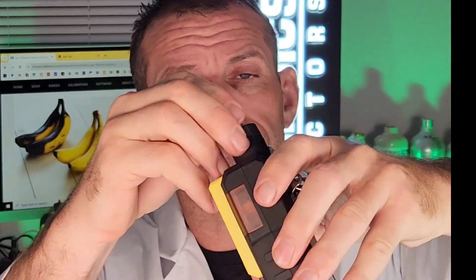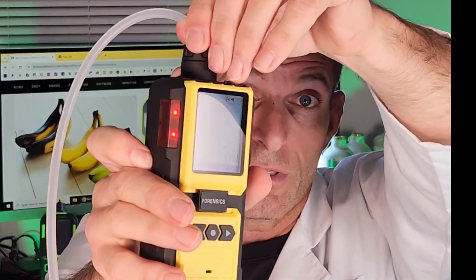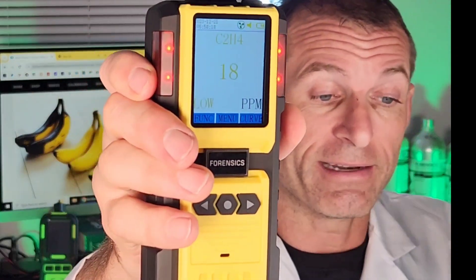We have a gas bottle of ethylene here — just pop on the tubing at the top and I'll show you the unit in action. We're exposing the unit to some ethylene gas and as you can see the numbers are going up. Once they reach a certain alarm threshold — which is adjustable — the alarms get triggered: LED, buzzer, and vibration. It's actually vibrating in my hand. I've taken off the gas and you can see the numbers going down. Very fast response, within seconds.